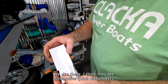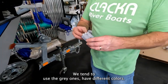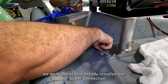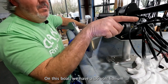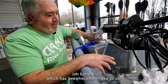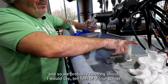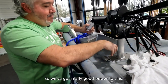Here's our clip — we use these automotive quick disconnects. We tend to use the gray ones, which come in different colors depending on the application. Inside the boat here, we've already installed our power connection. We use 4-gauge wire — gives it plenty of power to the motor. On this boat we have a 36-volt lithium ion Bioenno battery, which has been recommended to us. It's a marine-grade, single battery, 50 amp hour. Works really well. We're running about 10 feet of 4-gauge back to the battery, so we've got really good power to this.